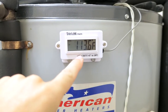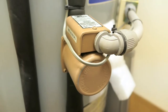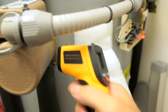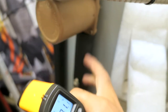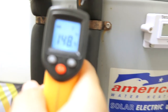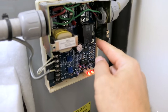Today is actually a cloudy day. It's been a couple of hours since it's been running and it's ultra hot right now. With this temperature meter, you can see it's 181 degrees on the motor — it is blazing hot. We've got 125 degrees in the tank, about 148 coming out of the solar panels from the top, and about the same going back into the panel. So I'm going to shut the pump off.